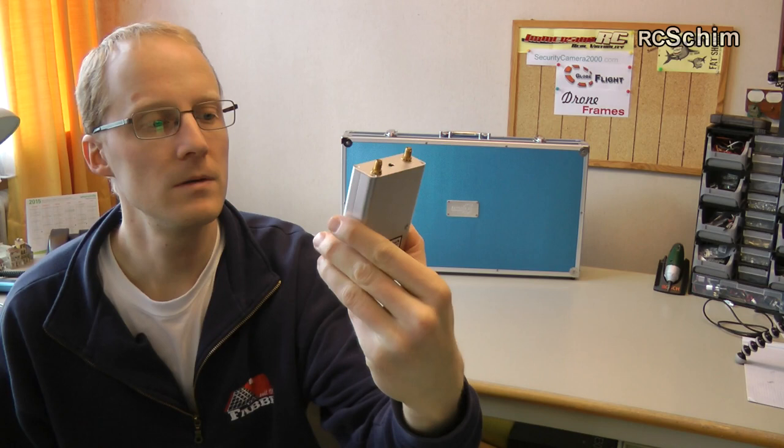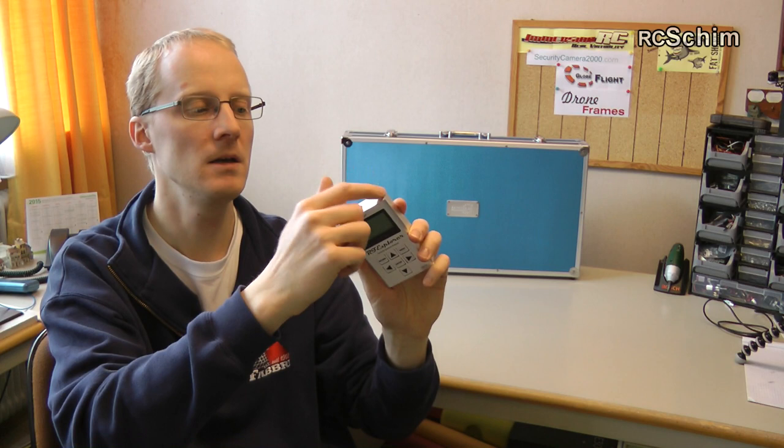A few years ago I got the little RF Explorer. It's a nice and handy device, which in my case has two models in it. It's a sub-gigahertz module from 240 to 960 megahertz. So this shows UHF on 433. And the second module I bought with it is the 2.4 gigahertz module. So with this device, I was able to scan the air for UHF band if it's free, and scan the 2.4 gigahertz band.